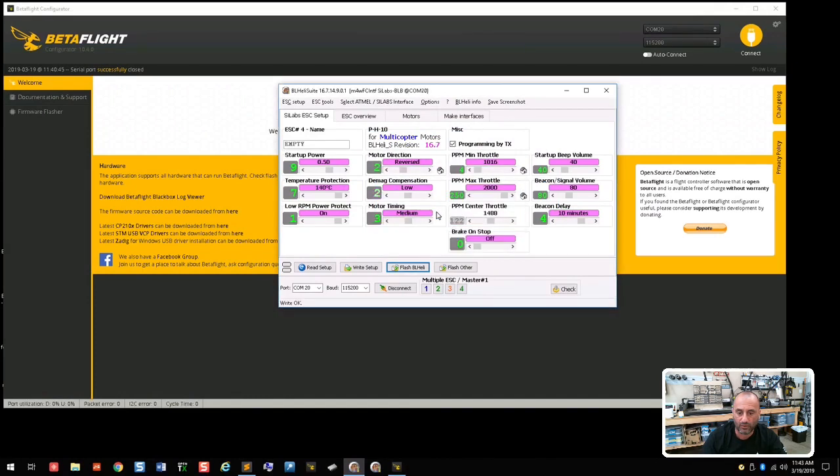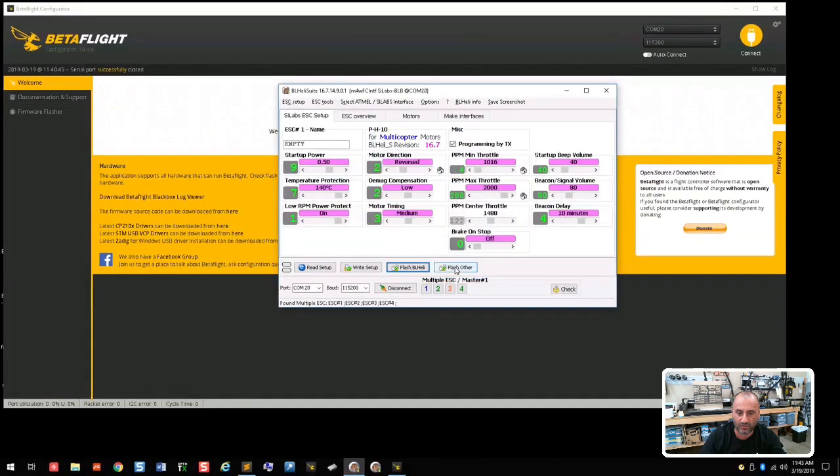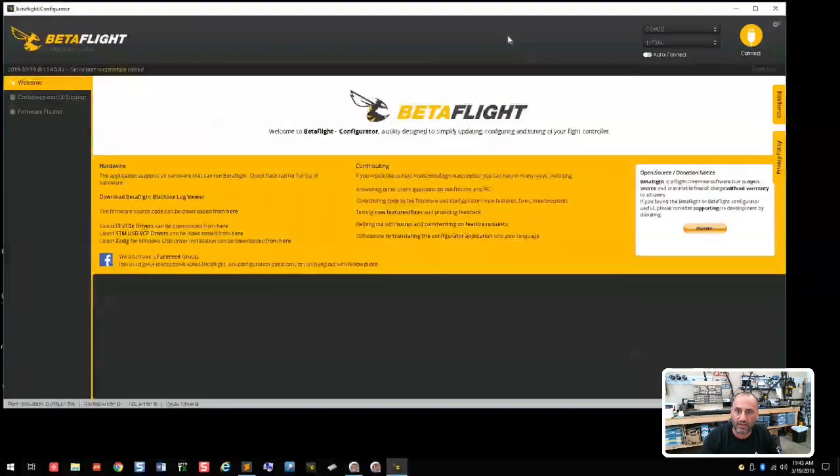Okay, so we just got done flashing these, right? Everything's got the new version, as you can see here. We're going to click OK. We're going to disconnect. Now, this is important. Once you hear those tones, go ahead and disconnect your LiPo, okay? Because you're going to be starting fresh now. And you're going to go back through the process, and I'm going to do it real quick this time.